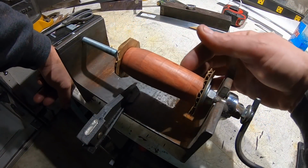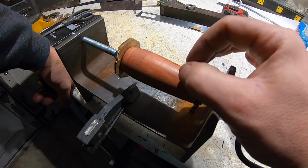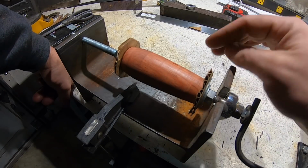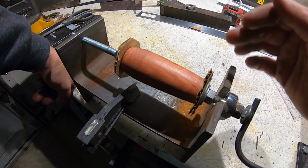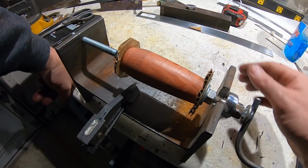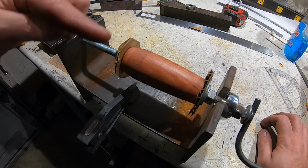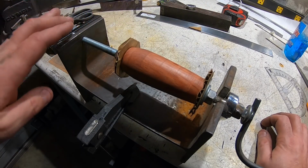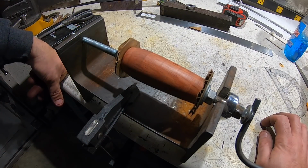So I finished doing the basic contours of the handle on the lathe. It's thicker than normal because the flutes are going to be concave flutes. So that's why this will be the top point. I've got it rigged up here. This is the jig I use to do wire wrapped handles, but I'm using this as a little guide because I need to put a grid system on here so that I can do the fluting and get it perfect. So that's why these little markers are on here. Now I'm just going to put a grid pattern on here so I can get that done.